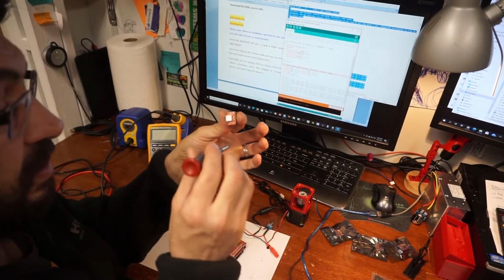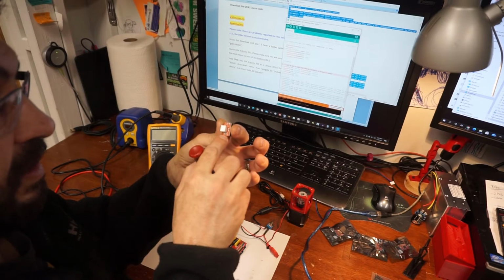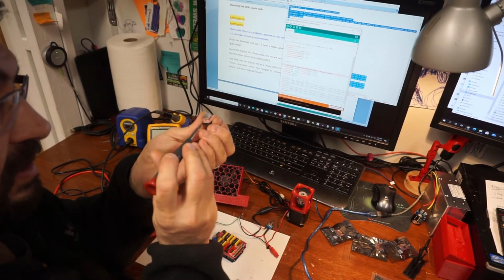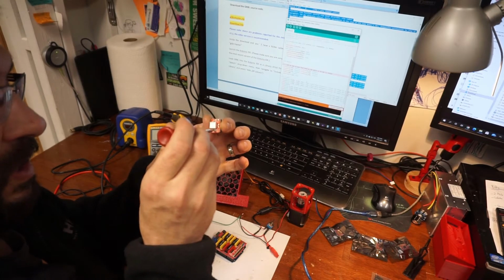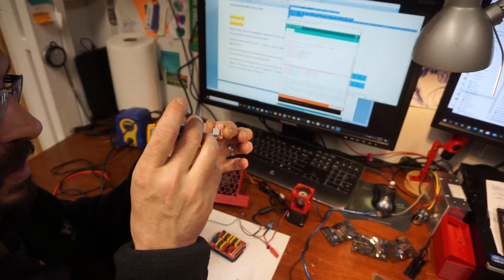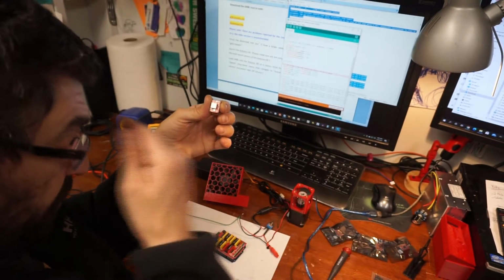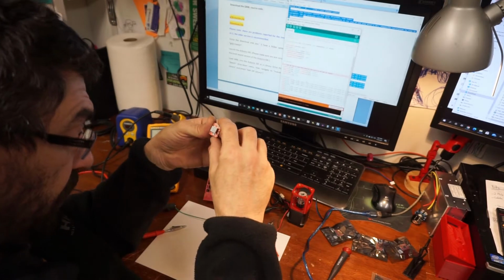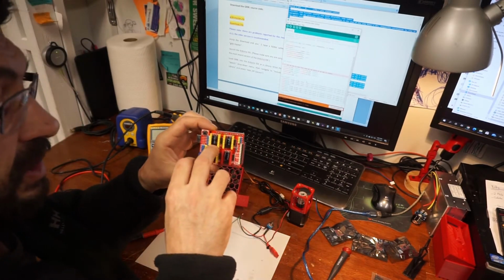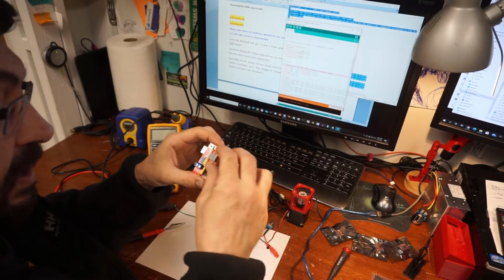Now I'm going to start with the potentiometer. It's at halfway, it looks like, because you can tell the little metal bit is halfway. But I'm gonna go ahead and turn down the voltage, the VREF, all the way down until I get an idea of what's going on. So I have the VREF all the way down. I'm just gonna use full steps for the test, so I'm not gonna change any of the granularity right now.